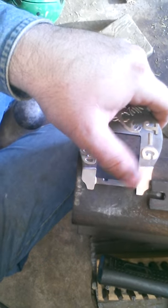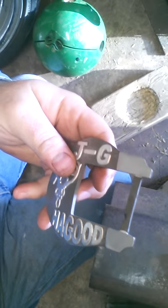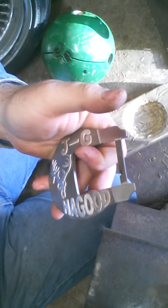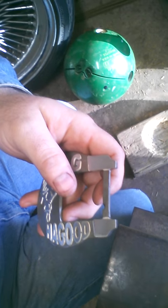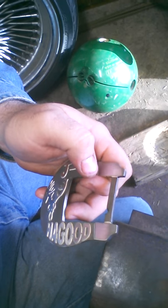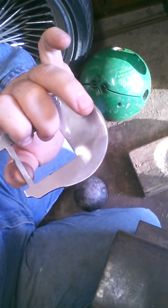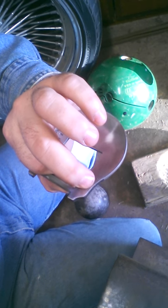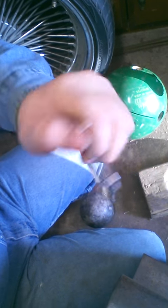I'll hit it right here where my thumb is and flatten it back out if it bends in. Now I'll cut this out after I've got it domed and measure this distance to make sure it's an inch and a half for this buckle. If it's not, I'll put it in my vise jaws and open my vise jaws up and spread these two pieces apart until they're an inch and a half. Then my next step is to put my tab in here and drill my holes.